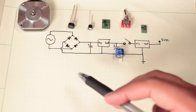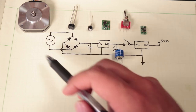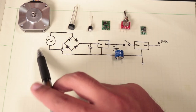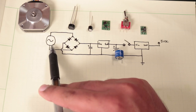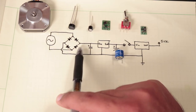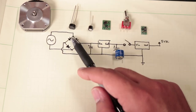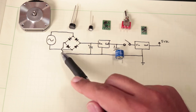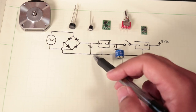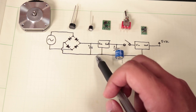Let's take a look at the schematic for the power circuitry. We can consider the stepper motor to be an alternating current source, which means we need to rectify it because we ultimately need five volts DC. So I'm going to be using a full bridge rectifier, which will give us a low voltage DC output. This will be relatively choppy, so I'm going to smooth it with a little smoothing capacitor.